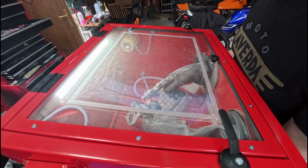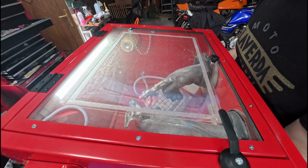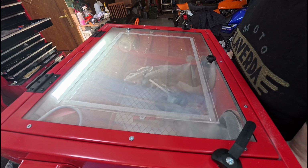But I did notice that the media wasn't recycling properly. Turns out you need at least 5 kg in the cabinet for a decent flow. Added more, still not quite right. Then I spot dust escaping from the cabinet side. Didn't notice that at all. I was too busy feeling smug. Then comes the eureka moment.